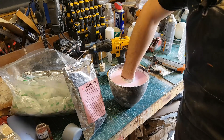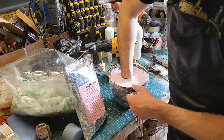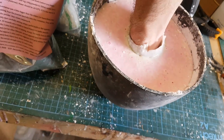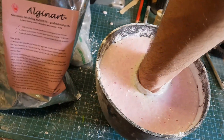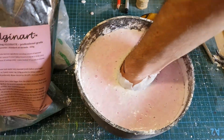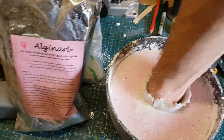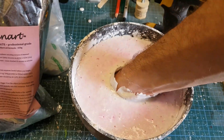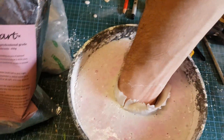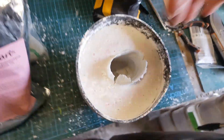All I need to do now is start moving my hand back and forth, trying to let some air into the mould. Because of the suction effect between my hand and the mould, it won't come out straight away — I've got to release that pressure. As you can see, the alginate has gotten a little bit paler as it's set, which is the chromatic aspect. This was a little bit tricky holding a phone and filming while trying to get my hand free, but it's just a matter of slowly working through it. You can also spray some air into the mould to release the lock further. Right at this point I could really feel it coming, so I braced it against my hip and slowly pulled my hand out.